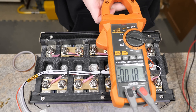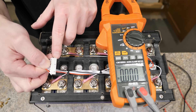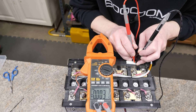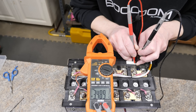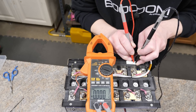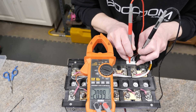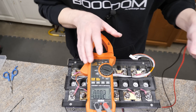Next we're going to verify everything is hooked up correctly by checking the voltages on all the pins. Put the negative probe on the negative wire and check voltages on each pin — it should go up in roughly three-volt increments. Cell one: 3.4 volts. Next: 7 volts. Next: 10 volts. Next: 14 volts. Next: 17 volts. Next: 21 volts. Next: 24 volts. Last one: 27 volts. All wired correctly. Be careful with the first one — your probes are close together and you could technically short it out.